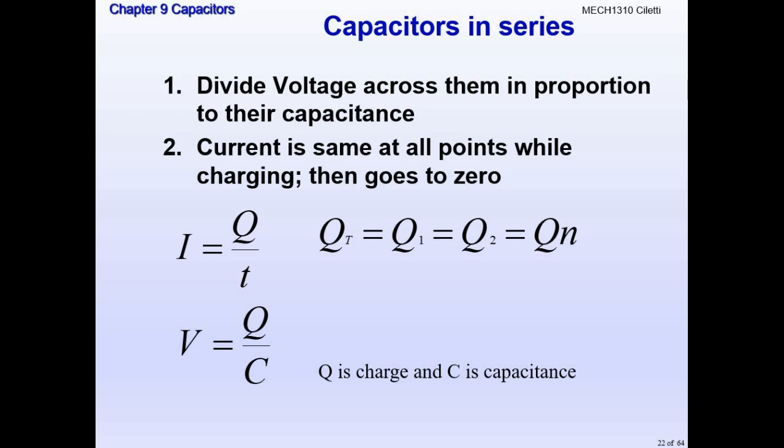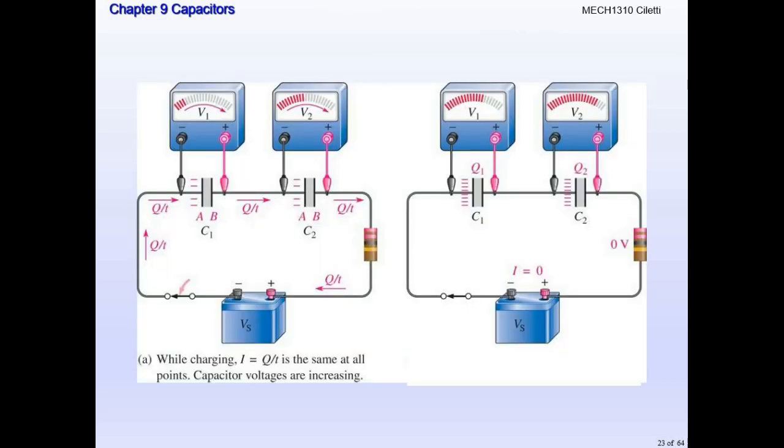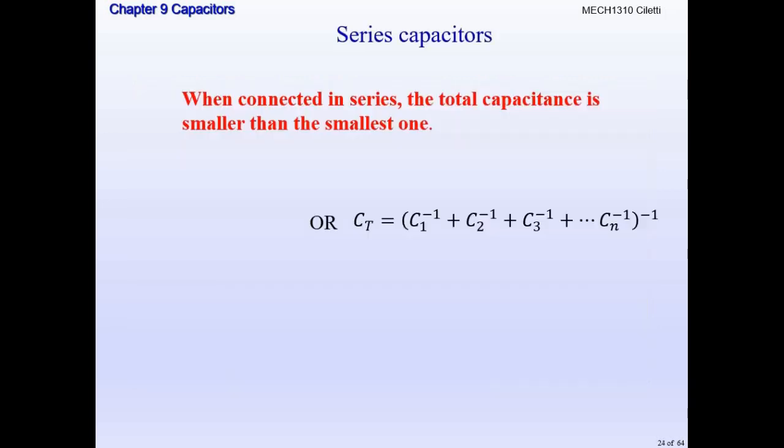There's two parts to a capacitor that we're going to talk about: its capacitance and its reactance. Its reactance is its equivalent resistive power, versus its capacitance, which is the charge that it stores. I'm going to do a separate side lecture that shows how we solve capacitors in series and capacitors in parallel. But essentially, we don't change the rules of KVL and KCL here, okay? We will still have a voltage drop across a capacitor, and the sum of the voltage drops has to equal the voltage source. We will have a constant current still in a series circuit. It just matters how we calculate the capacitance. So the ammeter still goes in series and the voltmeter still goes in parallel with whatever we're reading. That part doesn't change versus resistor circuits, all right?